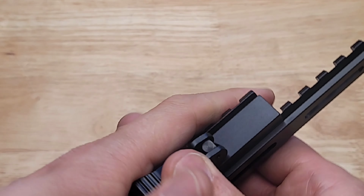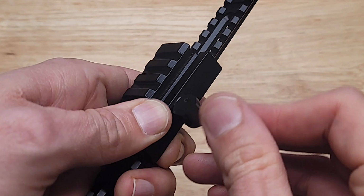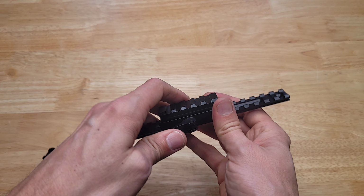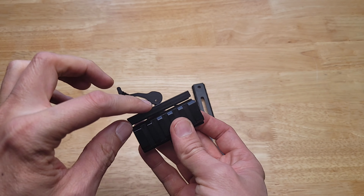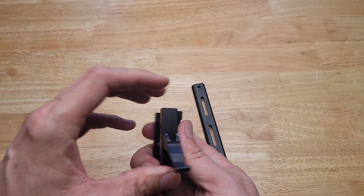And I think it could be made much better if there were some different interface in there. Bicycle quick releases, for example, have a piece of plastic, like a plastic bushing that the two surfaces ride on, or they use a steel cam piece inside instead of an aluminum cam. One easy solution to this galling is to add a washer between the two aluminum surfaces.